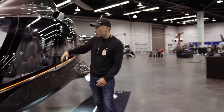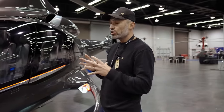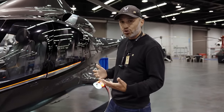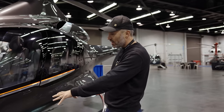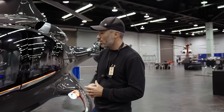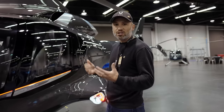I love the way everything is built into the aircraft. One of the big things Jason really wanted to focus on was making sure the aerodynamics were incredible throughout — from top to bottom. Believe it or not, you get about 30 percent of your drag from the undercarriage and about 30 percent from the rotor head. So the skidded helicopter is going to go about 15 knots slower than the wheeled version. The wheeled version will cruise at about 140 knots, so the skidded version will be about 15 knots slower. Every feature of the helicopter — door latches and so forth — is really designed with aerodynamics in mind.